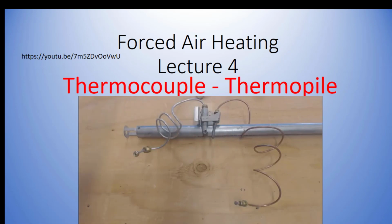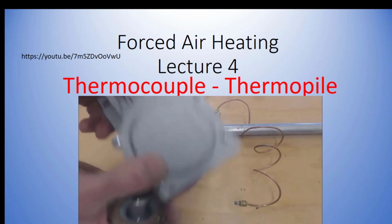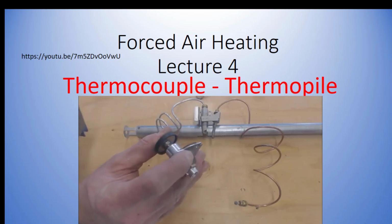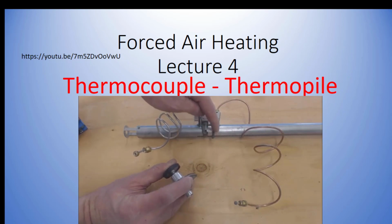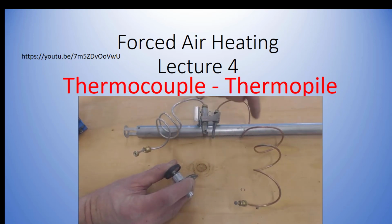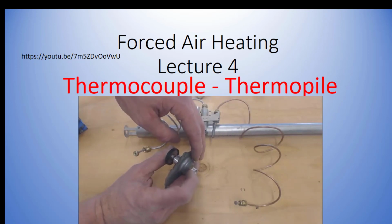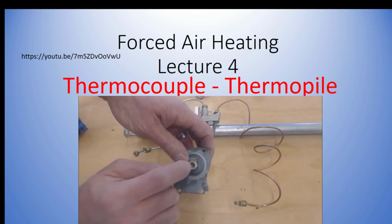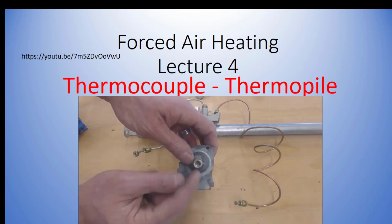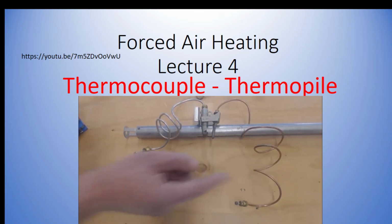So once again, you press this down, the solenoid comes down, and what happens is when you heat a thermocouple rod up, it actually sends DC millivolts over to here and into the back of the solenoid. The solenoid has two connections, straight down in the middle and the side. Okay, and the thermocouple has two wires as well. You have the inner wire and you have the outer wire.